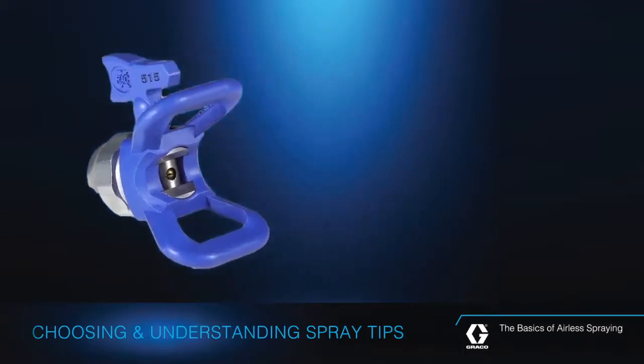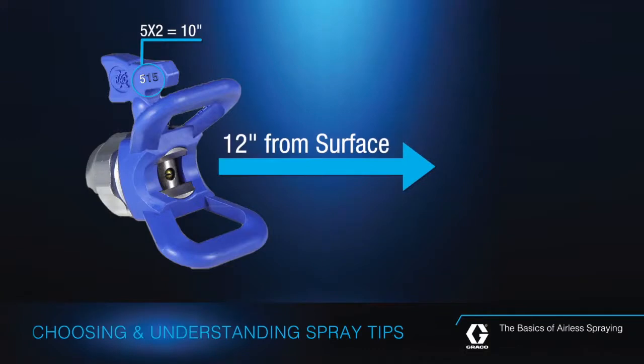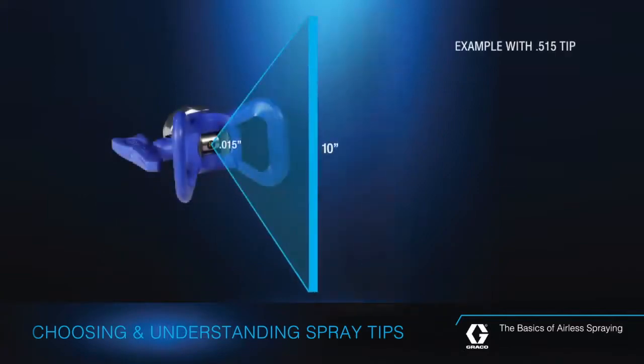The first number, when multiplied by 2, tells you how wide of a fan the tip will create when sprayed at a distance of 12 inches from the surface. The second 2 numbers are the orifice size of the tip in thousandths of an inch, and that determines how much fluid will leave the spray tip. For example, a 515 tip will spray a 10-inch wide fan and have a 15 thousandths of an inch orifice.